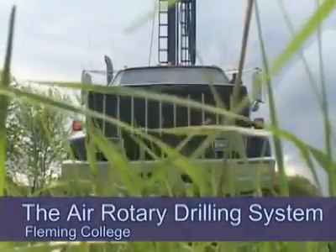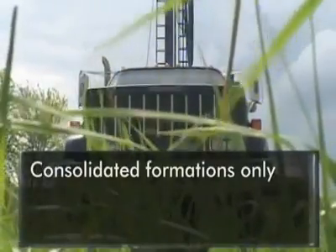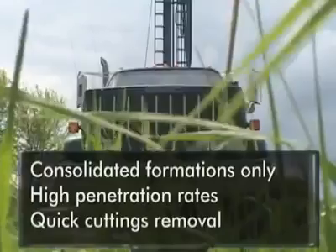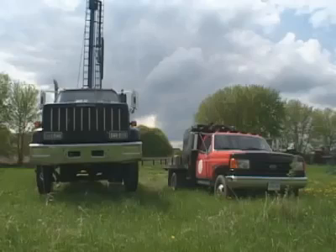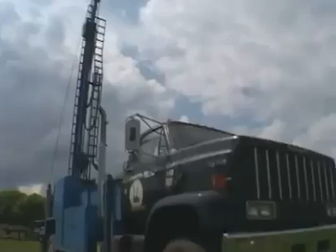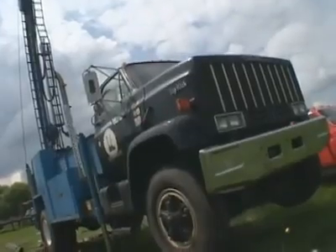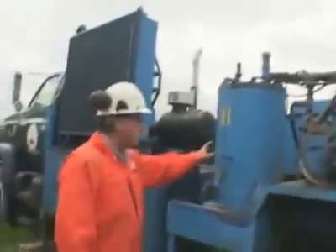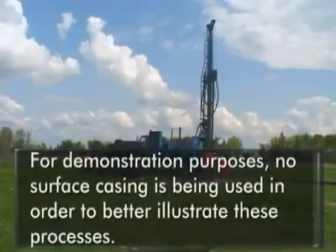The air rotary drilling system is primarily designed for drilling in consolidated formations, offering good penetration rates and quick cuttings removal. This system usually consists of a truck-mounted drill and a separate support vehicle which carries supplies such as water and welding equipment. If the horsepower requirements are similar, one engine can be used for both by utilizing a transfer case. This rig's equipment includes an air compressor and both water and mud pumps to help facilitate the removal of cuttings depending on the geology encountered.